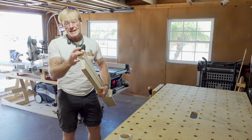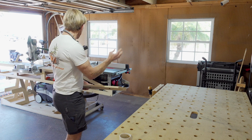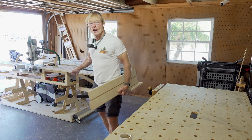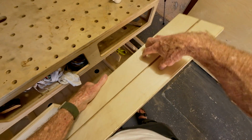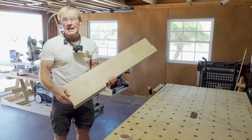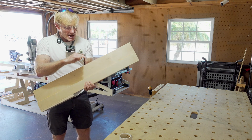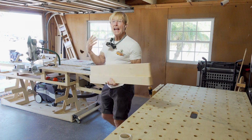Simply two boards, 18mm sub fence, this shop made T-track. This is the same T-track that I use on my router tables and on the miter extension. So it's pretty typical. And this allows me to put in feather boards or hold downs. And then I added this back piece of 18mm and it was glued on and some dados cut in it. And this was just to attach it to any table saw.